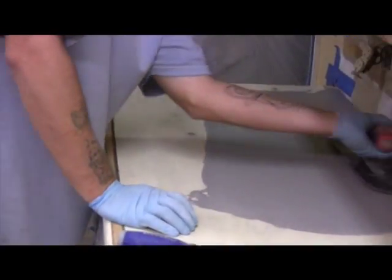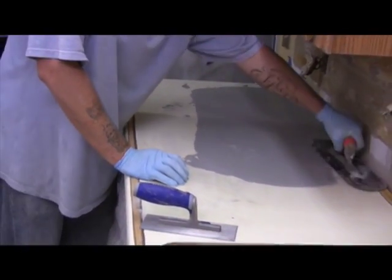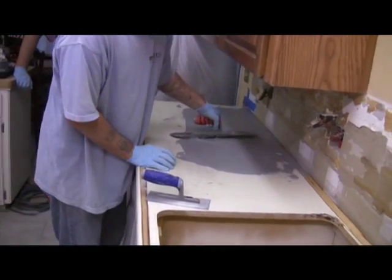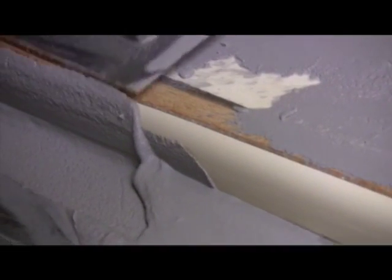Now, lightly prime the surface before pouring out the bond coat material. Notice the consistency and make any adjustment when you are mixing. Spread evenly with a trowel. Note the use of rubber gloves to protect the hands. Cover the entire surface with a thin but uniform coating. Imagine the trowel gliding evenly over the top.